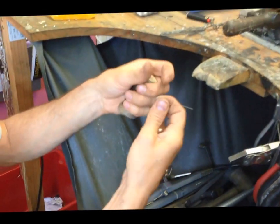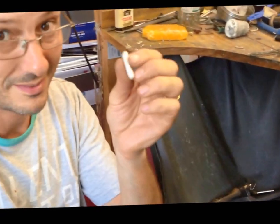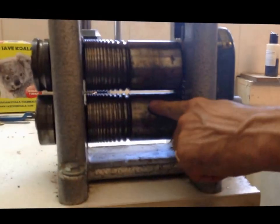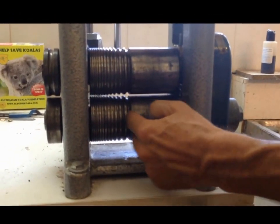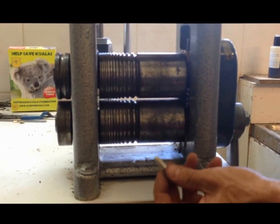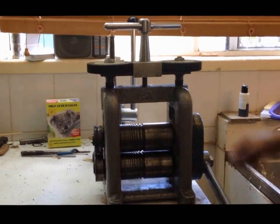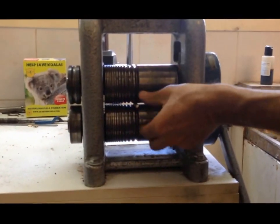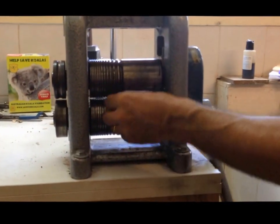The reason I haven't cut the wire is because I can always reuse it. Next, we go and roll this out — making it longer and thinner. These are rolling mills. The height of the plates is adjustable. The flat side can make sheet, and this side can make progressively smaller square wire. We're going to make it into square wire. We put it in and roll it through, then turn it round so we're doing the other side, because it gets compressed on the top and bottom.